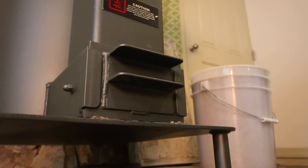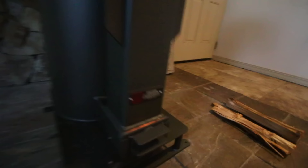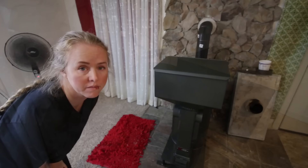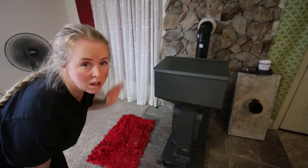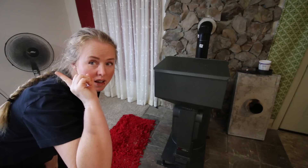That's how simple it is. At this point all I need to do is stick around close by for a few minutes and make sure it didn't take off — but I can see just through the crack that it's still going. That sound is the rocket stove running on pellets. We're about five minutes in with the rocket stove and the basement is already about 10 degrees warmer. The top is not yet really hot, just warm, but the good news is there's no smoke coming out of the side, no back puffing, nothing bad going on with the stove. The fan is on now to move the air into the rest of the basement.